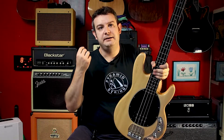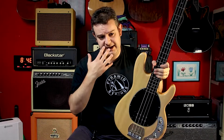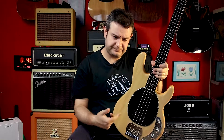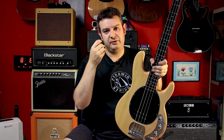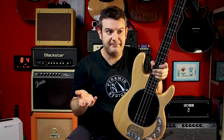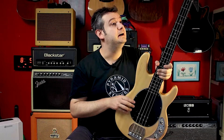I also made the wiring with MusicLily potentiometers — MusicLily Pro 250K — because this humbucker is made from two coils. In this case I have two separate volumes so every bobbin of the humbucker is controlled by itself. My thought was to treat the pickup just like two separate single coils.